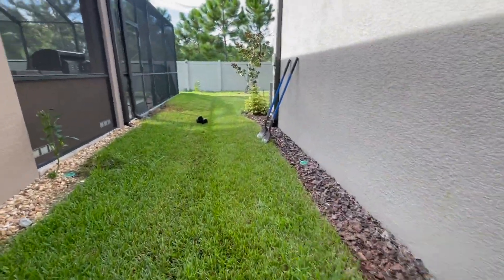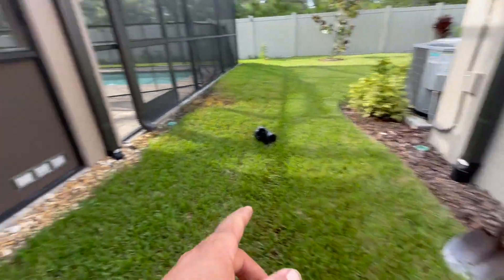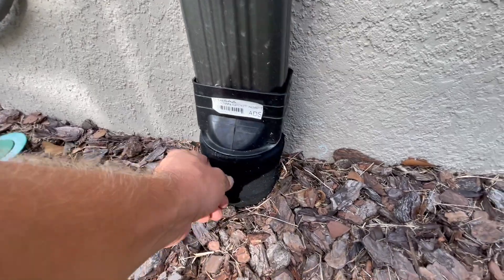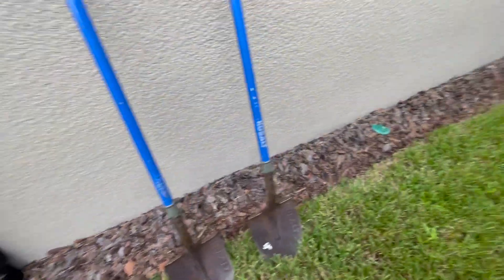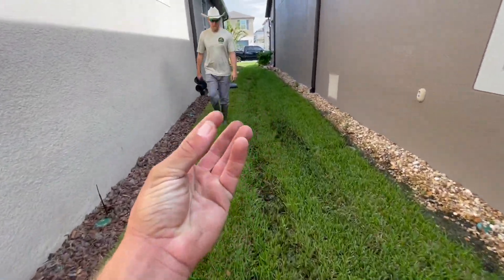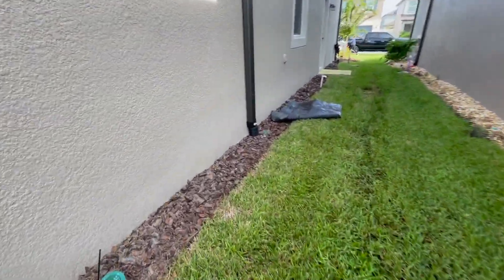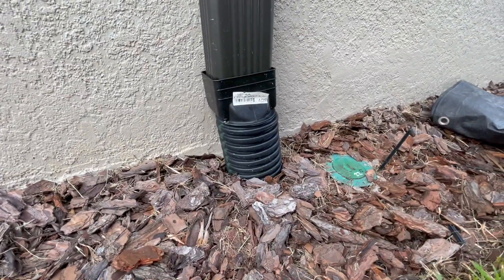Both sides of these houses are actually done already. They have the downspouts redirected. The builder did both of them, so we're not really sure what's going on. We've got these downspouts right here going into the ground with some wrapped pipe, which means it's probably perforated inside — solid pipe with holes made for water, designed to let water absorb into it and carry it to the end of the line. But then on the other downspout connections, they run solid pipe for some reason.